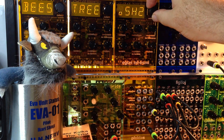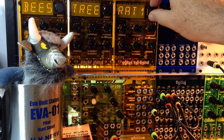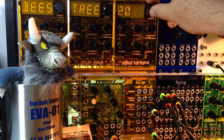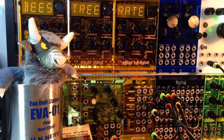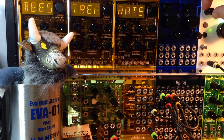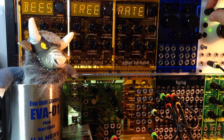What we'll do is slow down both of these. So we'll slow down LFO 1. Okay, so this is the FMCV input. We've got a fixed voltage going into the FM input from frames, and you can see that as I increase this voltage, the LFO speed increases. And the same occurs with the envelope durations as well.